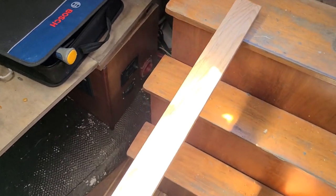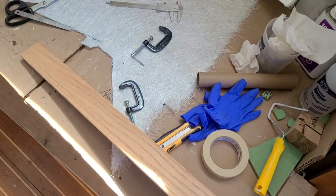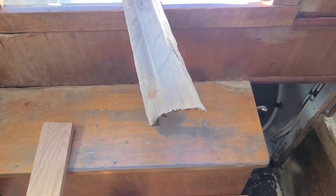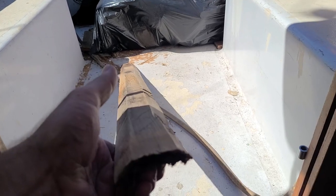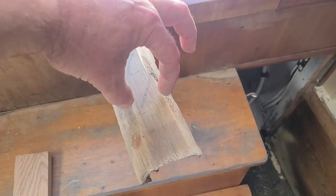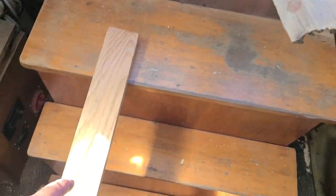Now the battery drill is charging, and I have some spare time, so I want to make something nice from this nice piece of wood, something like this shape. So I need to cut the 45 degree sides, but the problem is that the piece of wood is wider than I need, so I will just measure the length of the bottom and transfer it to here, and then cut it whatever it is, and then fill the gaps with resin afterwards.